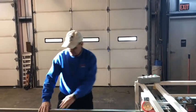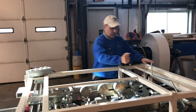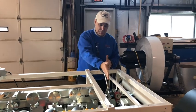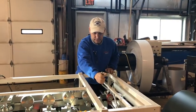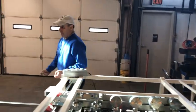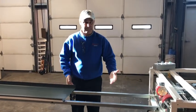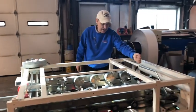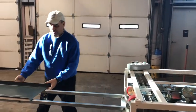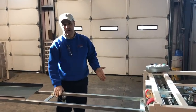So let's say the panel is still on there and I shear this off. Remember when you're measuring for your limit switch you measure to this shear. When I go back it will feed that panel out and begin to feed the next panel in. Meanwhile I take this off, and then when this panel comes out to here it will stop again. I want automatic — I shear it off, it starts out and feeds that panel out. When it gets out I move the panel and then the switch goes up. When the next piece comes out it will stop.